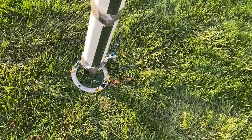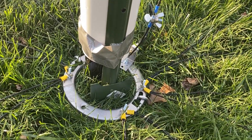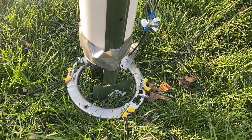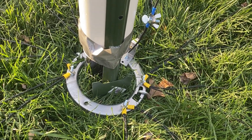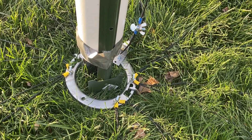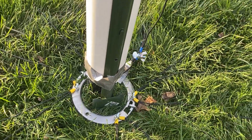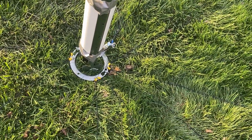There's what is popularly referred to as a toilet flange — one of those things that you screw to the floor in your bathroom and attach your toilet to — and I'm using that as a radial plate. I've got 16 eight-foot radials coming off of this thing, and that's two wavelengths of wire for a 20 meter antenna, so that's working pretty good.